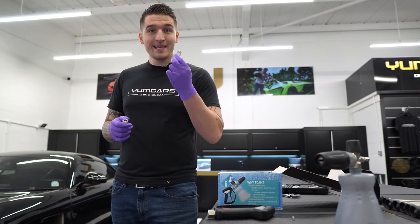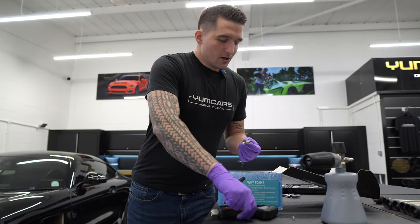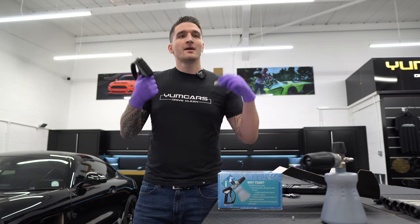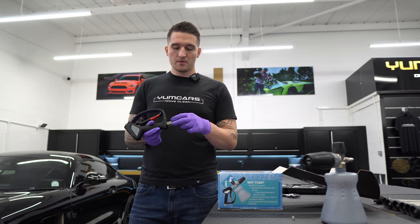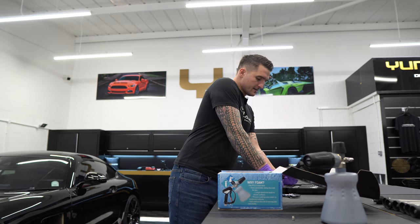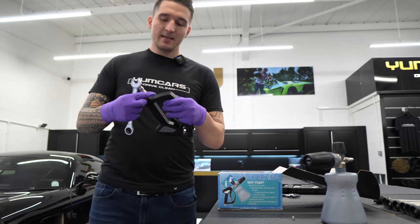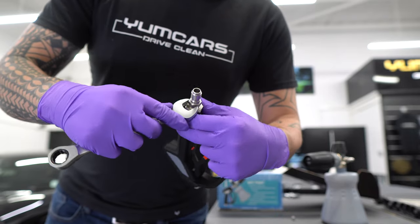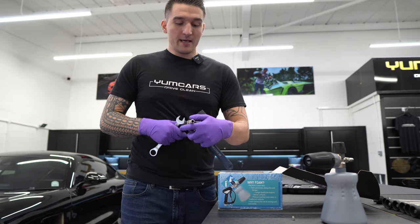The two remaining parts: you've got a 3/8 male fitting — this quarter inch and this 3/8 look very similar, it's just slightly bigger in size. This will go into the inlet of the gun, because it will then hook up to our stainless steel 3/8 coupler that will go onto your Kränzle or any M22 machine. Again you will tape this — this is slightly easier to go in. At hand tightness you take your 17mm spanner. You can see every time you tighten it the swivel also moves, so you can either grab the swivel and tighten it, or get another 17mm or an adjustable spanner, hold it in place, and torque it down.